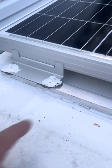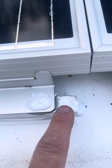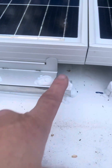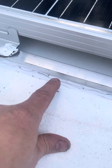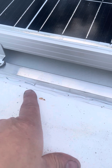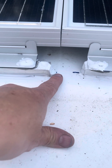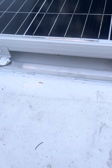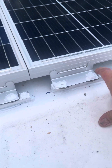It's going to be 800 total watts. With the three-quarter inch tubing and the brackets that come with the rigid panels, what I did was drill a hole bigger than the screw that comes with these — the ones you're supposed to put into the end of your roof. I didn't want to put all those screws in, so I just put one here; the head fits through and drills in on each end. Then on the bottom I used VHB high-tack double-sided tape, cleaned it with alcohol, pushed it down real good, and where the screws go through I put a dab of lap sealant underneath. Then I screwed it in and mounted everything to the tubing with stainless steel self-tapping screws.